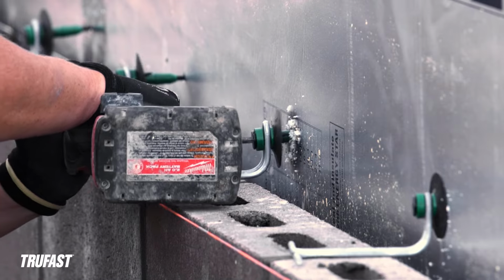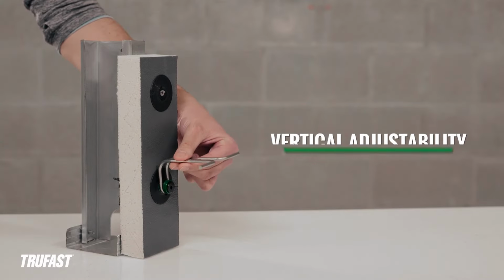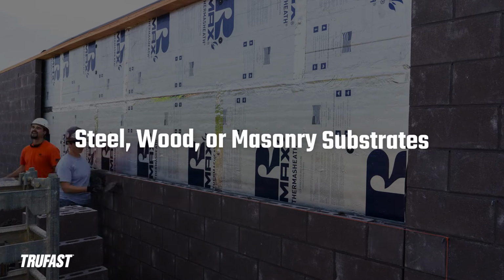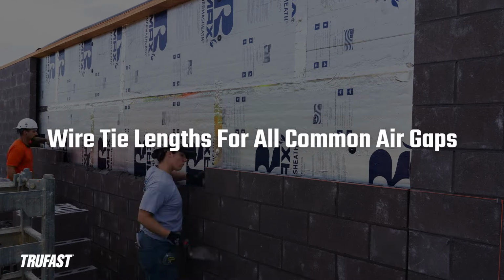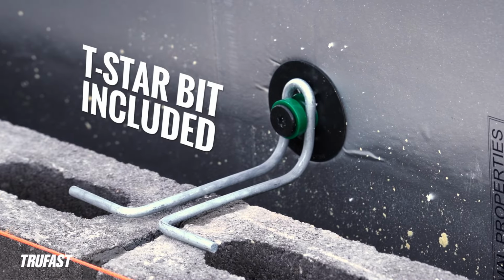The MVA can be installed fully assembled, saving your masons time and money, and the wire tie allows for vertical adjustability. Available for insulation and sheathing assemblies 1 inch to 4 inches thick over steel stud, wood stud, or masonry substrates, along with various wire tie lengths for all common air gaps. No special chuck adapters are required, as T-star bits are included in every box.